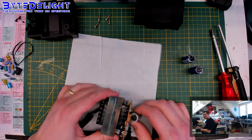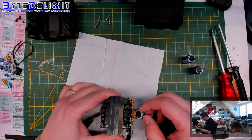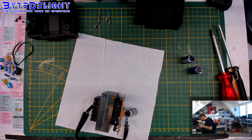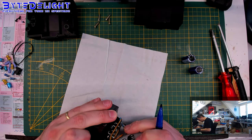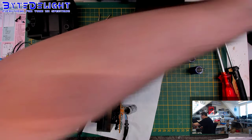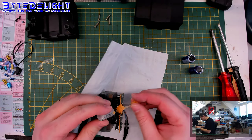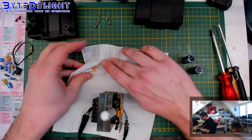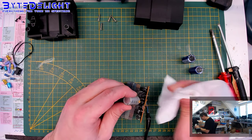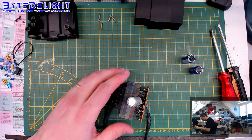And you can see that's the way Sinclair did it. He just put the legs of the capacitor around the board. So let's just do that as well, and let's add a quick mark to know where the negative side is and the positive side is, so we know. No one will know that we marked it on the board here. And this is sticky. You saw it happening here. Okay, let's get it off and put some new adhesive tape in between here in a moment.